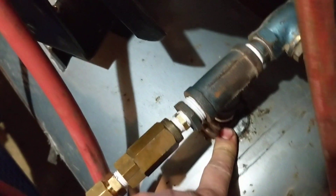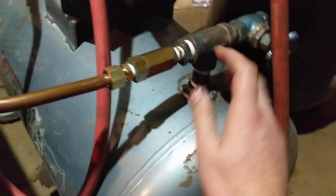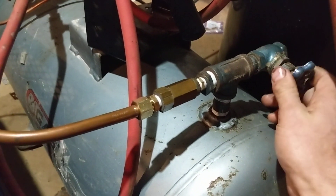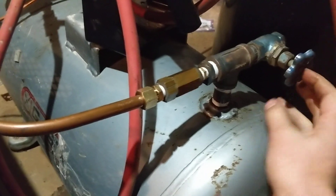One of the recent changes was shortening the copper run into the compressor and adding an inline check valve I had laying around. The old one wasn't seating correctly - it's just a piece of nylon with a spring. This new one is built similarly but beefier in design. I teed it off at a right angle so it's level with the compressor output. I didn't have a half-inch NPT pipe plug, so I used a spare valve I had laying around - and now I have an additional outlet on the compressor if I ever need it. For now it just acts as a plug.